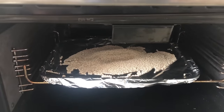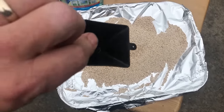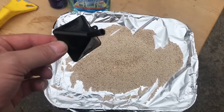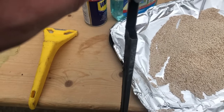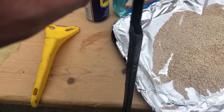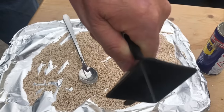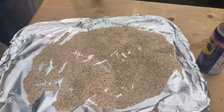We've got the desiccant in the oven at low heat and it's a lovely white colour, so we'll remove it and proceed to refill the aluminium spacer. I've got a really small funnel to aid in filling — it nearly fits in the tube, so I'll just use my fingers to guide it, being careful not to distort the tubing, and use a spoon to fill it up.